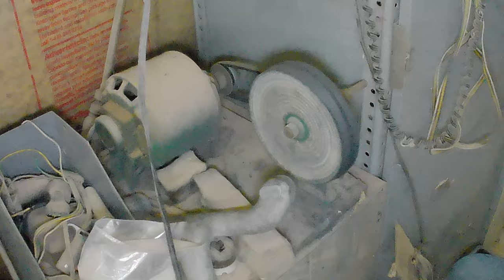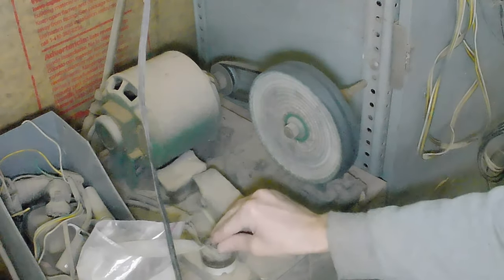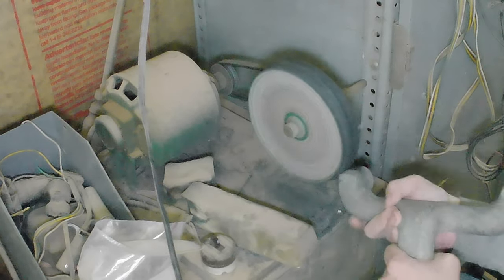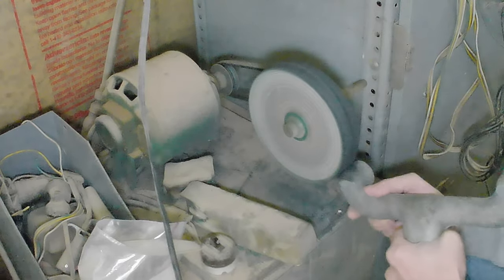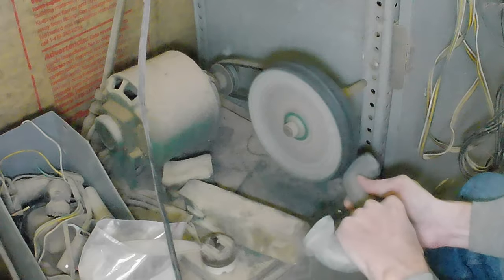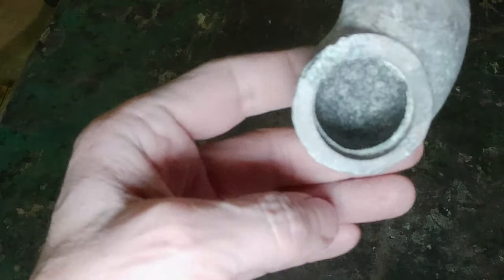Here I am wrestling with my buffing wheel with the intention of polishing it, which you're about to see didn't really turn out all that well. I think we're going to skip ahead a little bit because I go at this for a while. Here we are with the quote-unquote buffed result. What I'm pointing out in there is there are casting defects inside this in addition to the aluminum oxide. In that process I noticed there were a bunch of scratches and some really deep digs that I was never going to get out. So I decided to go with option B. You can see some of the scratches — this thing's been through the wars.